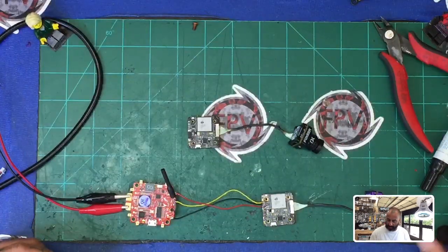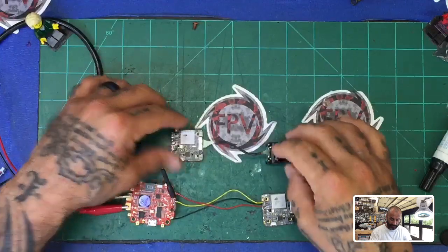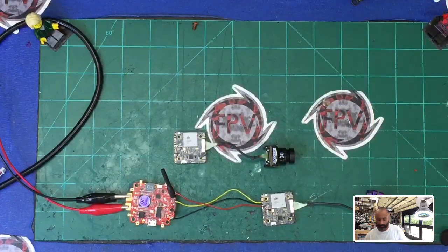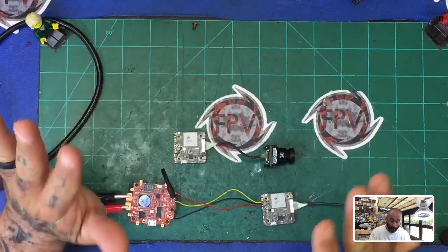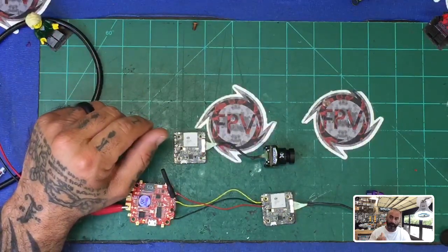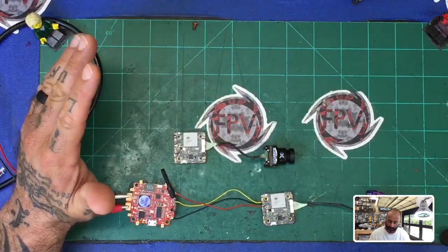Me and Foxeer don't seem to see eye to eye on this, at least not yet, and I'm hoping this video will help shed some light on it. Here's what I've done — this is the Foxeer Mix that I was flying yesterday and the day before. It's brand new, went into one of my brand new builds that I was testing. We did about 20 to 30 flights with it and there was not a single problem. Then, once I got a memory full or SD card full error, I took out the SD card, put in a new one, and that was the end of it. I lost all power on my board, my camera quit working, I had no more video, and that was the end of the flying day.